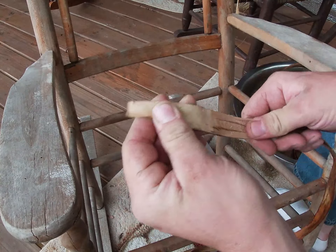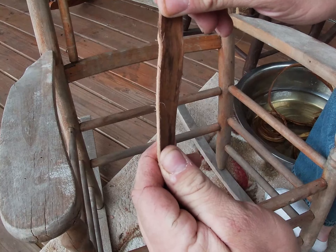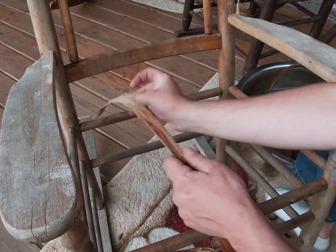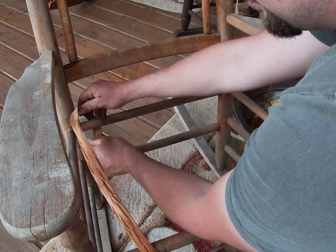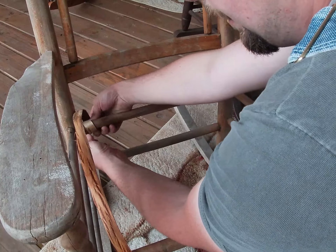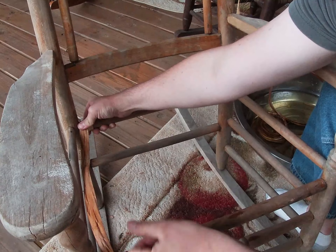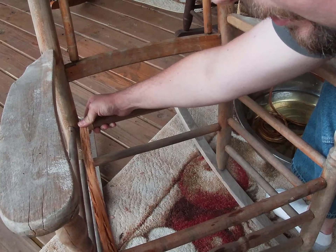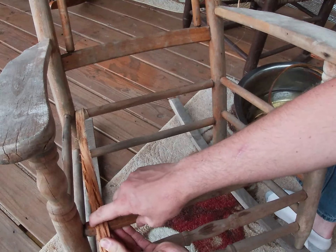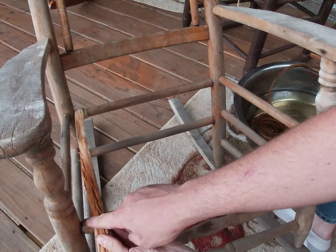What I've done for this first piece is I've shaved the end down a little thinner — that's about the thickness I use. I shave this end down just a little more, and I'm going to go over the top first and wrap it around again. Then I hold that in there, pull this tight over it, and come up front and start around the front here. I leave a little gap here because these rocking chairs are wider in the front than the back, and you want this to go straight.